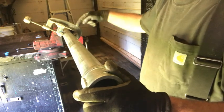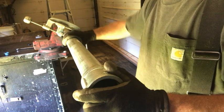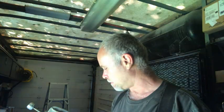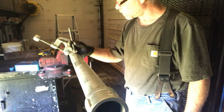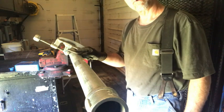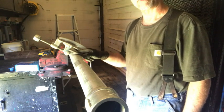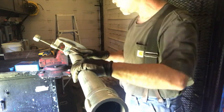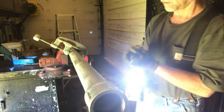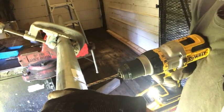You caught me changing my mind — I'm going to put a couple of pins through here and set this in the concrete so it would never turn. Just drill a pilot hole first and put rebar rod in there for a little more insurance to keep the pipe solidified in the concrete.